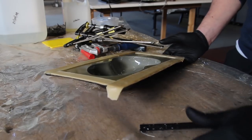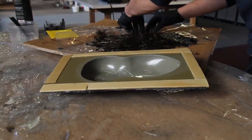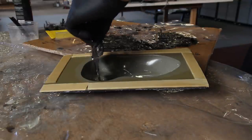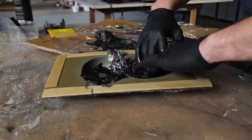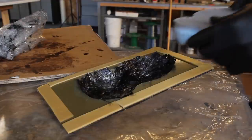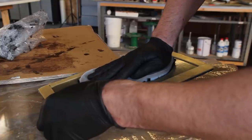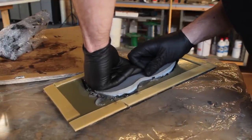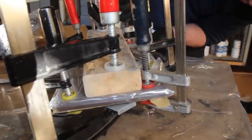So I'm preparing the molds. I've added some resin on the chopped fibers. At this stage I'm not looking for a perfect resin-to-fiber ratio — I couldn't measure it from the infusion samples we did before. I know this is going to be a very resin-heavy part. I'm just looking for the best finish with the least amount of time invested. This is a simple mold and a simple part — I'm just looking to get more knowledge of the technique, because sometimes things on paper are different from real life. I added some wax strips — two millimeters thick — and a silicone core to add pressure. We'll get way more pressure with this technique than with vacuum: vacuum gives minus one bar, while with the clamps we could get up to two or three bar or even more.